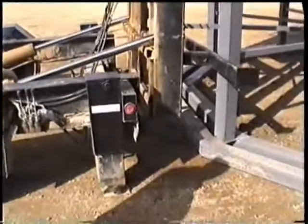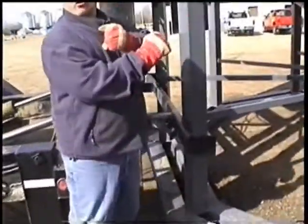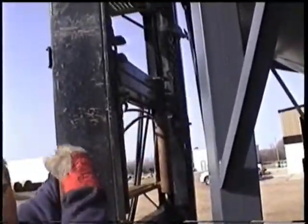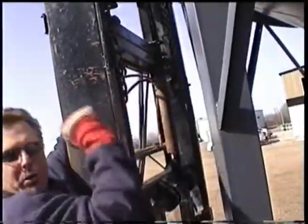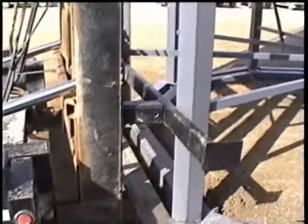At this point we're not pulling, we're just lifting it up to tighten it. Watch — the very first area that's going to come off the ground is probably down at the bottom end, which means it's not putting stress on the legs trying to kink them over. That is the problem when you chain around here and just try to do a dead pull against the ground — you're just trying to drag the leg down. With this system you're lifting and pulling, so you get the weight off the front side of the skid and you won't have any trouble. It's important to adjust your bumper so you have it against the bracing — all bins are different but get it as close to the bracing as possible.